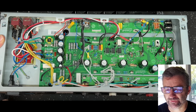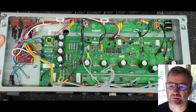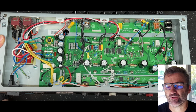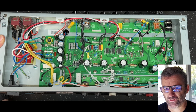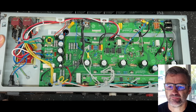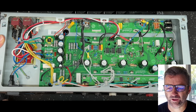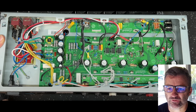Now you'd need to get access to these switches here if you wanted to configure it the same way that I have, where I can configure the jumping of the channels. But nonetheless, you could get access to the gain pot by using the header here, because on the gain pot you get access to the input to the pot as well as the wiper, and maybe you could pull this 1 meg pot out of the PCB and flip it around 180 degrees and solder directly to the top of it. But yeah, it's interesting. The Origin50 has 1 meg pots here already.